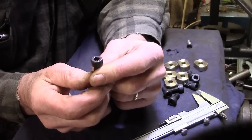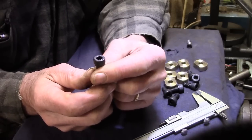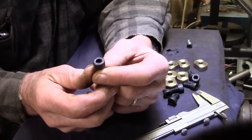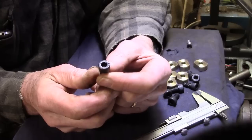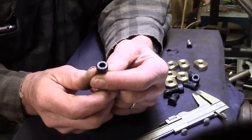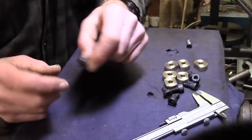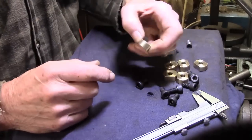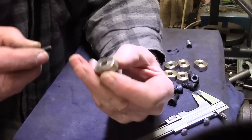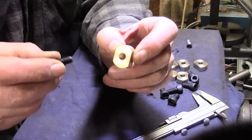So I've set the four-jaw up for an offset of 30 thou. I've got one or two spare bolts, so I'm going to try 30 thou and see where we go from there to get enough eccentric offset. And the other thing I've realized, I wasn't really quite clicking last time, these are all bored through clearance